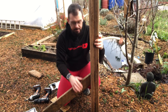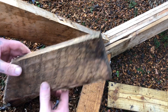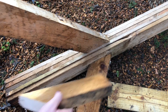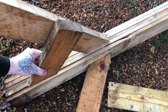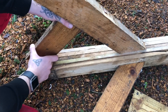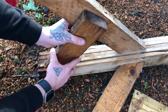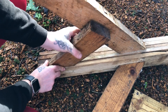With three pieces currently attached, we're ready to attach our first support while it's still flat — that's just going to be one of the smaller pieces of wood that we cut. We've only got one screw in here so it's not very strong at the moment, so we're going to join this by lining it up and screwing it on. We could have positioned this leg further out at an angle, but I don't feel that's going to give it as much strength as this design, so this is what we're going with.